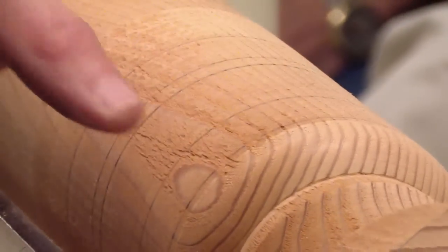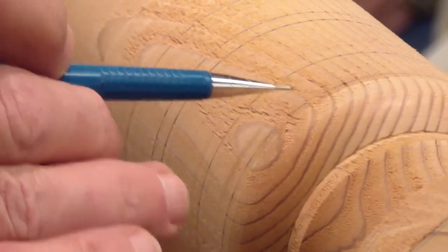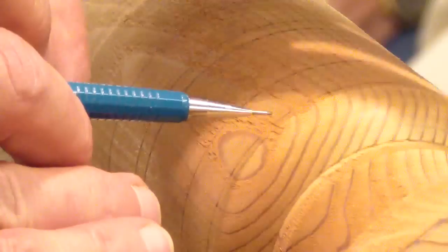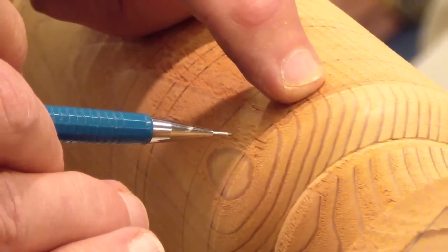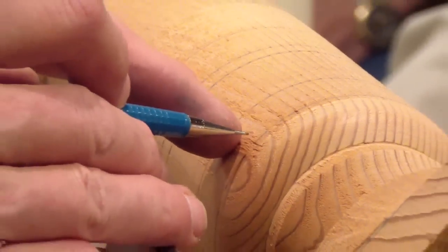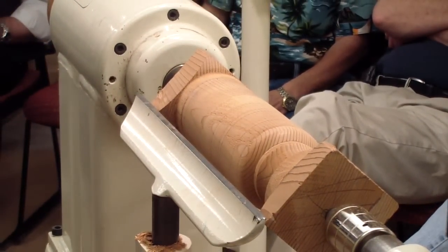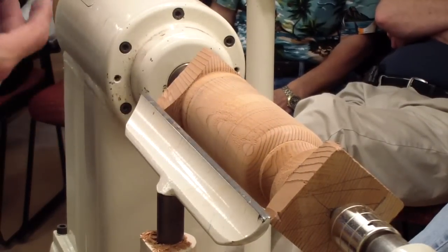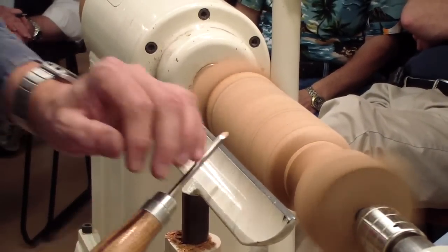We've cut so that on this redwood, you bump that once with 80 grit, that's finished. Where we left this rough, when we cleaned this, now you can see why I wanted this full face, because this is a major diameter. Now if you quit right there, and you go ahead and turn your stuff to shape, when you sand, when you get rid of this, now you do not have a very defined piece. You got a flat in there. So if you've forgotten, then just simply come back and cut it down some.